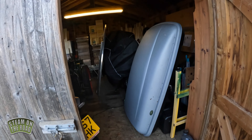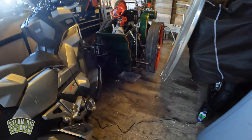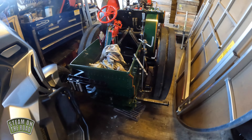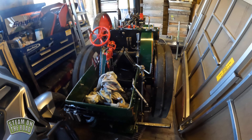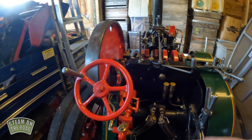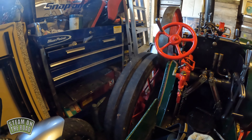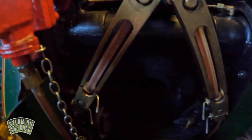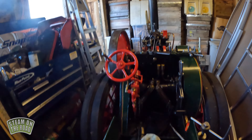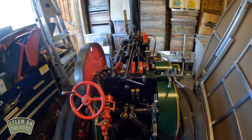It's a bit of a mess at the moment — there's a motorcycle under there and another one here — but here's Tilly. There's a fire grate on the floor ready to go back in when we start commissioning her again. At the moment she's in winter mode, so everything's been drained down. The pressure gauge has been taken off to prevent frost damage, and we've left everything open to allow air through the boiler to stop corrosion and damp build-up.